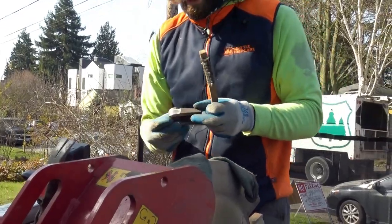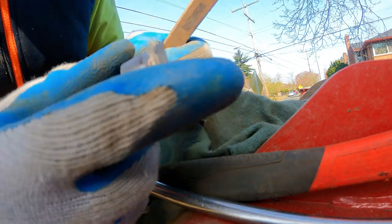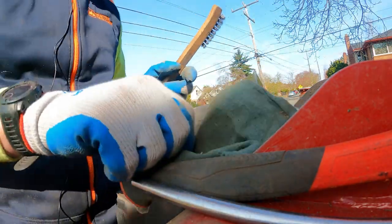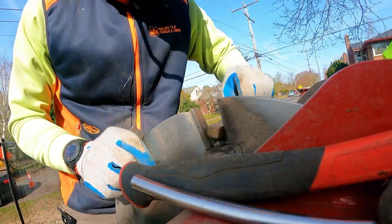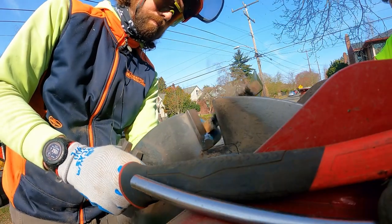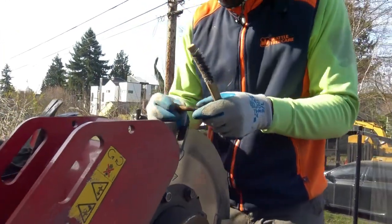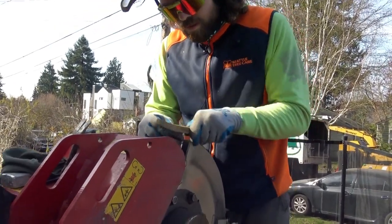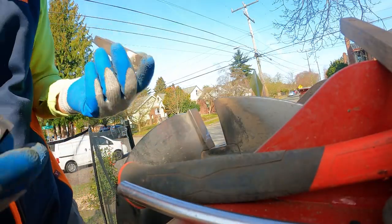Here's a good comparison — you can see a new tooth is all finished, nice and sharp. Well, not technically sharp, it just has an edge to it. No chips or anything. Then we're going to clean out the pocket and make sure everything will fit. I'll do the same thing to the bolt so the threads are nice and clean. You don't want a tooth flying off. I've never seen it happen, but it has happened — just look it up on YouTube.